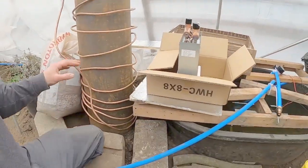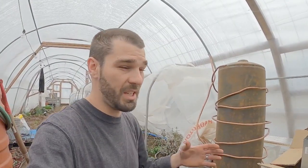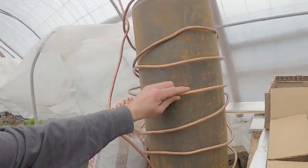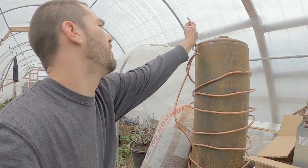My plan is to take all of this copper and basically bend it around some object — maybe five to six inch PVC, probably six inch. If I had five inch PVC, I could get a really firm grab on the actual stack itself because the copper wanted to coil in. Whereas if I bent it on a six inch PVC, I don't know if it would hold as tight — I might have gaps, and that's not what I want. This was kind of a crazy little experiment and it worked decently well until I ended up ripping the copper up and twisting it all.